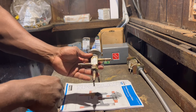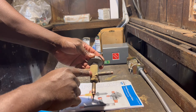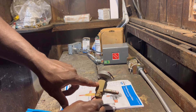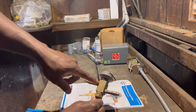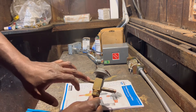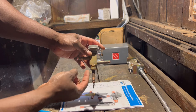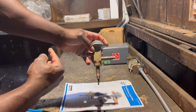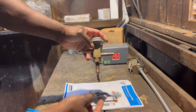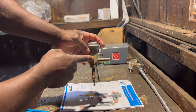So pretty much what I explained the other day — you have your D, your C, and your R. This D comes from the discharge, right off the compressor discharge line. You just T into it and come in here; that will be your bypass. When it gets cold out, this comes from the condenser — correct, up here to the bottom. You go through the compressor, out to your discharge, to your condenser, turn into a liquid, and it goes up here. The condenser ties in here as a liquid and then goes to your receiver.